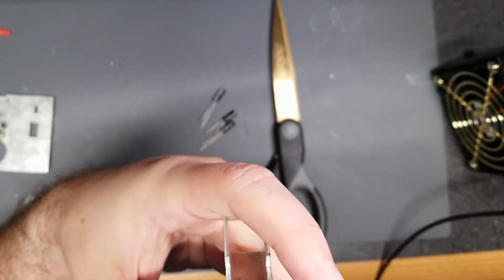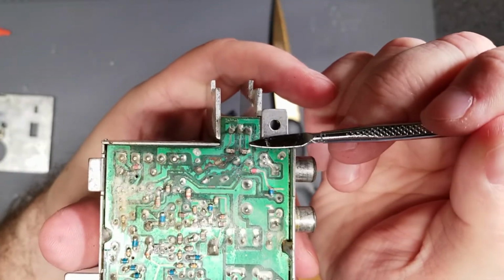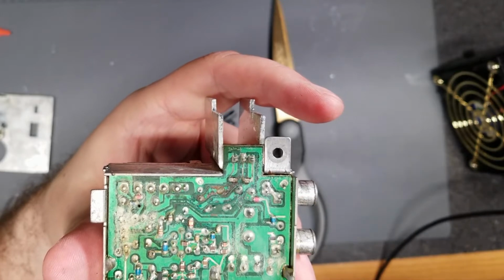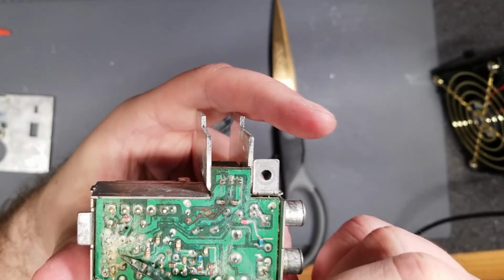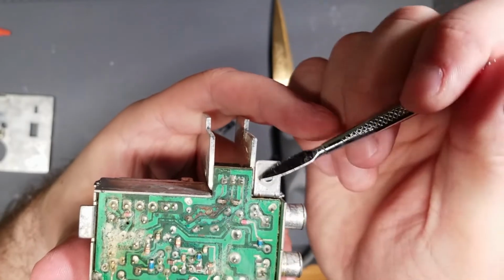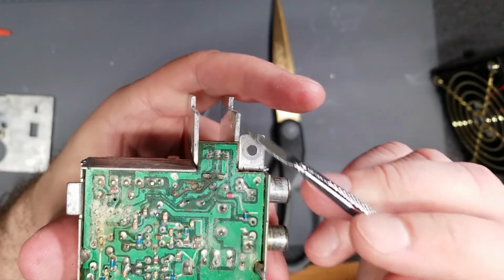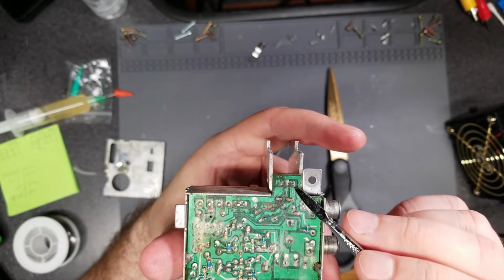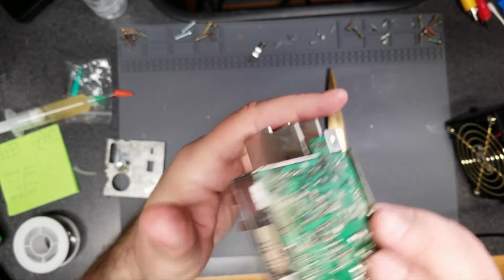to wherever it goes, but because of all this corrosion that's here, I mean, you've got this little, I'm guessing it's a capacitor there. You've got some other capacitors, resistors that are just covered in corrosion. This can be cleaned here. This I'm concerned with over here. And again, that pad, if it's just that pad, it's probably not that big of a deal, but if I can't get this corrosion clean, it's not going to matter very much.